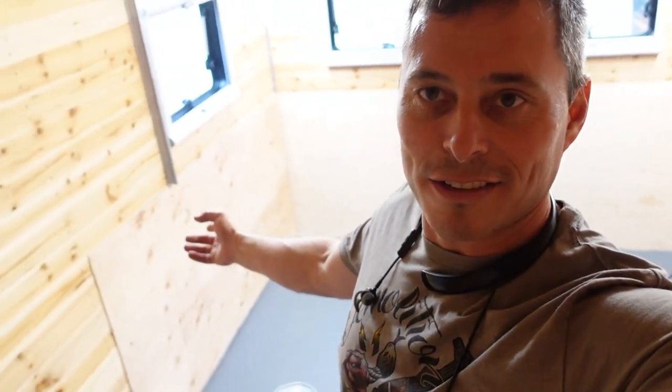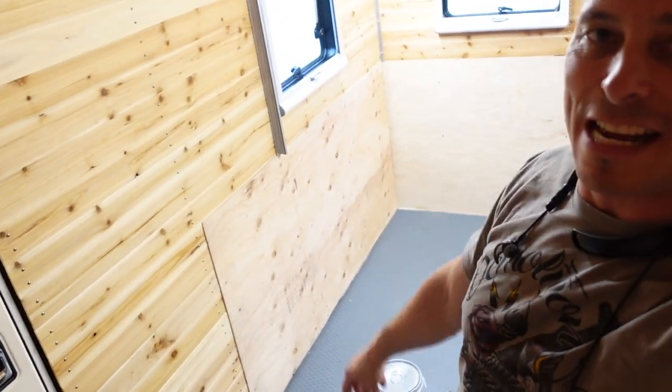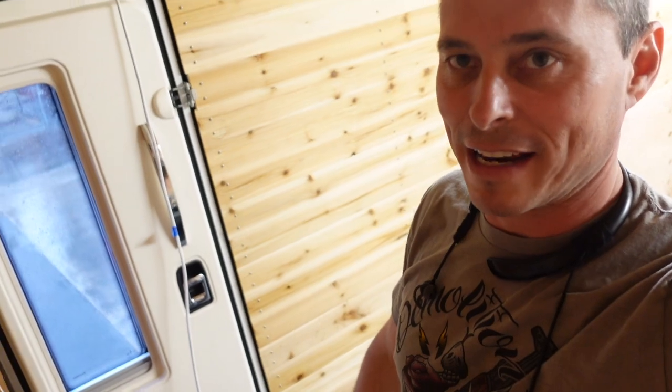So one thing I've been saying I was gonna do — and I'm of course not — is cutting the metal for the 8020 extruded aluminum. What we've decided to do today instead is get our pass-through wall shimmed out, get that seal, the seams caulked, the nail holes caulked, and then we're gonna go ahead and RedGuard it for waterproofing because it's going to be the wall behind our shower.